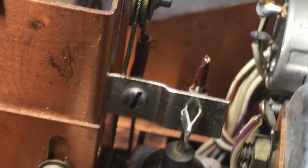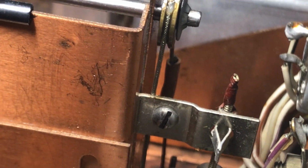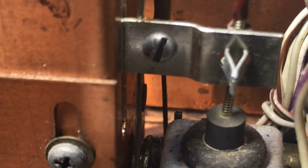And these clips, you don't want these clips that are on the other side of the screw. You don't want those clips to bind on the frame. So this clip here on this side, I actually had to put it in vertically to catch the cable in the right spot. And this clip here I put in horizontally, as it seemed like it was a longer travel. So that all worked out fine.